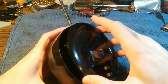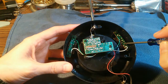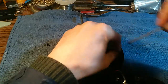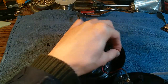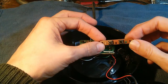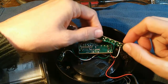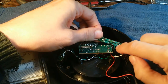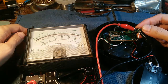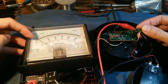And we can now remove the back. We've got two carrier boards here, each with two buttons on it. We'll start with this one — two screws on each board. Those are the two switches right there. When these switches are depressed, it should create a connection from this point to this point. I've got my ohmmeter connected across those points and I press the button — and you see our ohmmeter doesn't move.